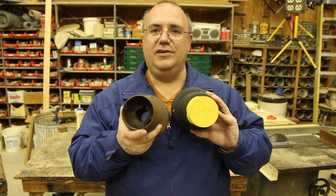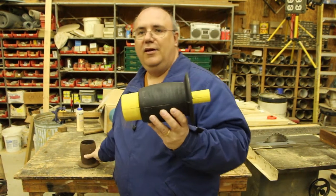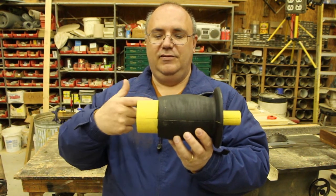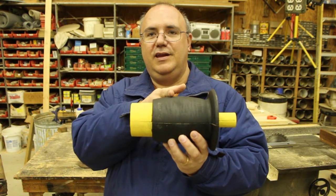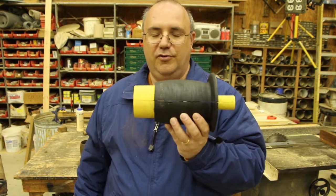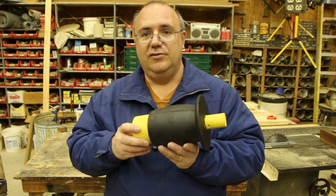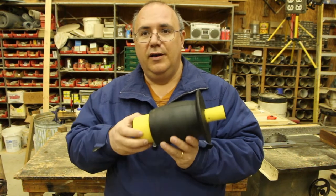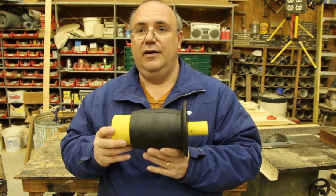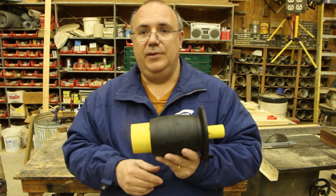This larger end is about three inches in diameter and it's going to go about two inches deep inside the pulley. So when we make our core box, you can imagine this yellow piece going inside here about two inches deep, and then it'll go down to the smaller diameter of the shaft that goes all the way through. We actually have to build the core box, which will be what the foundry uses to make the actual core that will go into the pattern. So we're going to get busy actually building the core box.